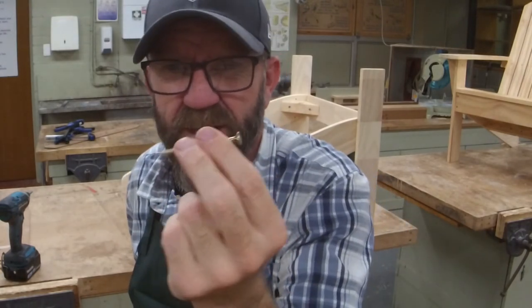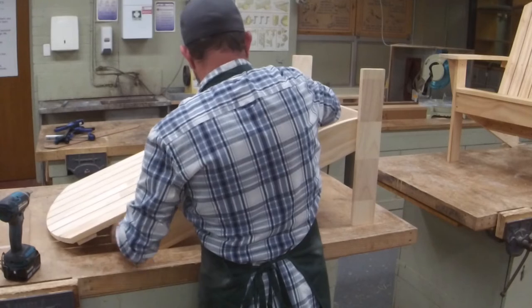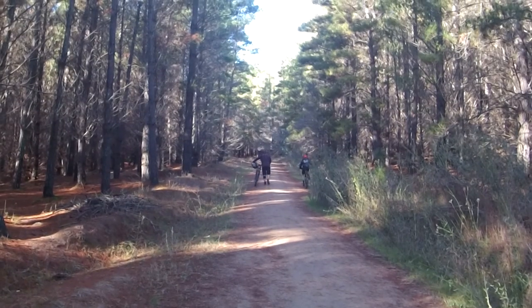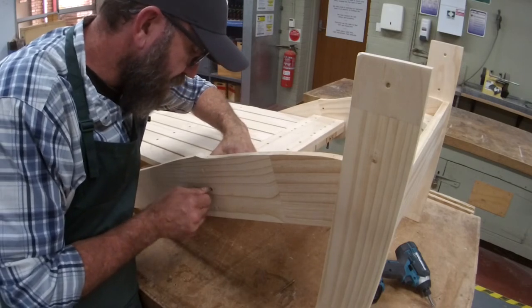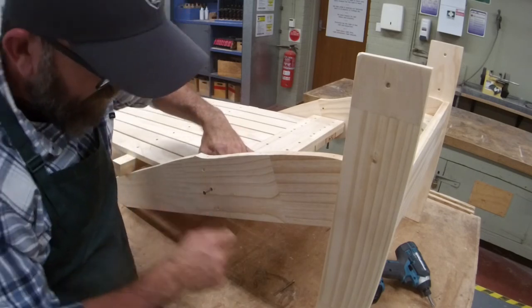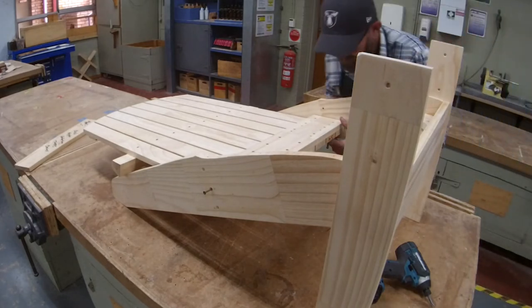All right, now we're going to attach the back. For this one, you need nice big screws, like 65, 70, something around that, because we don't really glue this area. The glue won't do much. Sorry, my back's here. That's not going to work. This is not a bad part to have a mate help you out, but you should be able to line up our center hole, that pilot hole we just drilled, and screw it in by hand. Just do the middle just till it locates, then jump on the other side. Same again.